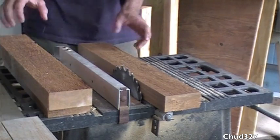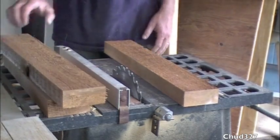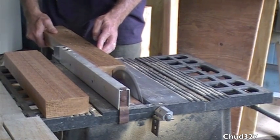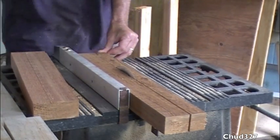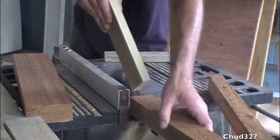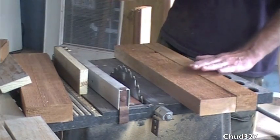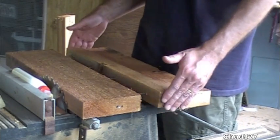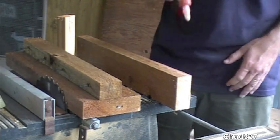Turning the 2x4 into a 2x6. I'm going to rip this, then screw and glue it together, and I've got my 2x6. It'll be on the back side so you'll never see it. These 2x6s are about $13 each — I'm going to use these scraps and do it for free. Gluing it and screwing it.